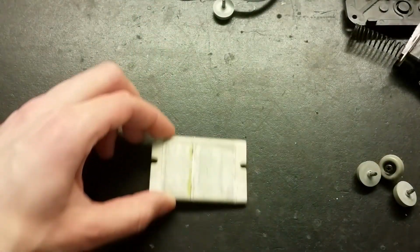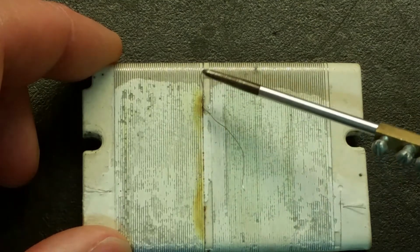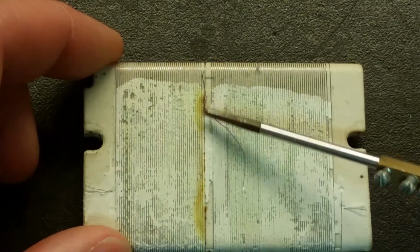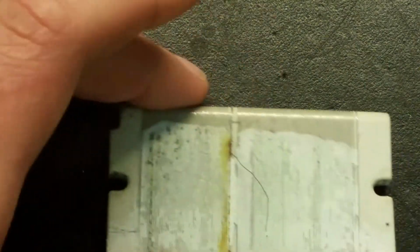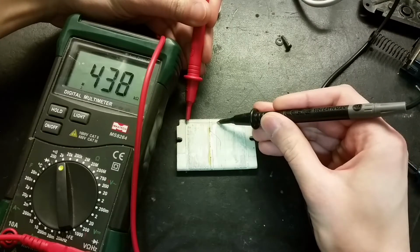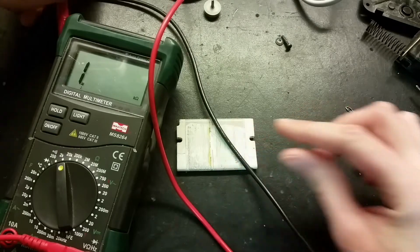If I have a closer look at this resistor, this is quite strange. It looks like somebody has tried to repair it. They have twisted this wire around here a couple of times. Looks to have been a little bit of bad connection here. It got hot like this. The same on the other side here. See, this goes from here and twists around this one. And if you measure it, it seems to be okay. Maybe this little piece of wire here had been shorting out to something.